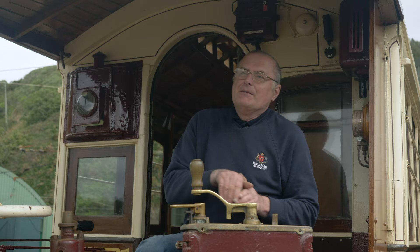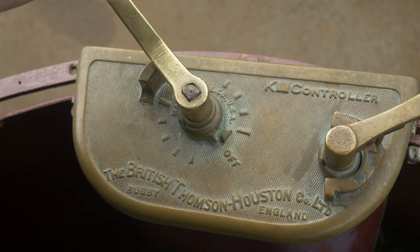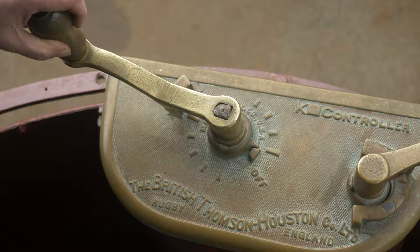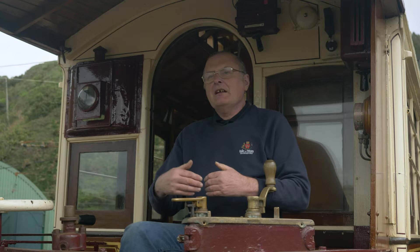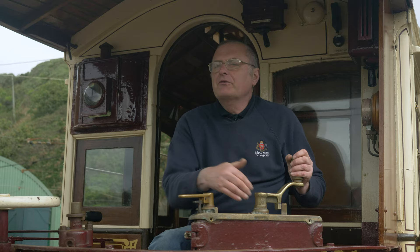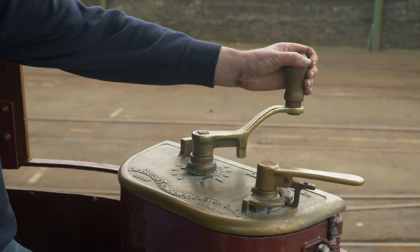To make it a little bit more complicated, it's called the series-parallel controller. In the first five points the motors were arranged in series, and by going through what we call a transition point and moving up through parallel points, the wiring and the controller changes to parallel. All the motors are now sharing the overhead power, but again with resistance points we go up gradually to run point nine — that's your maximum power, no resistance, and all the motors in parallel.